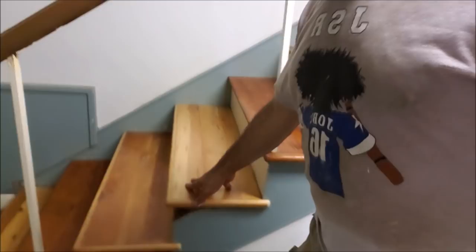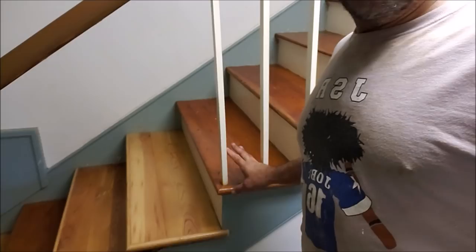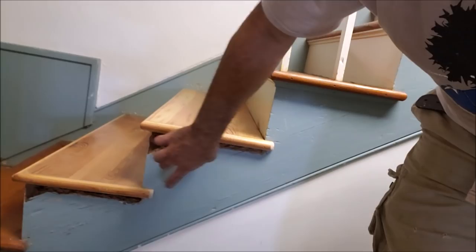One last thing we're going to take a look at here, and we didn't actually film it, is Mr. Lucas. Say what's up. Hey! We ended up putting in our stair treads. Now, the color is a lot lighter, but it will actually age rather quickly now that it's been exposed to the light. So within a few months, you'll start seeing the patina. This one looks like it's starting to age. Yeah, this one looks darker than it did already. Now, we had some other issues to deal with too: some more termites have been in here. So we're going to cut out these sections, fill that in, and then paint that when we come back.